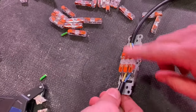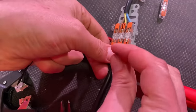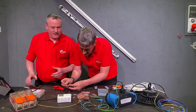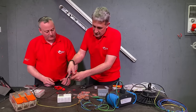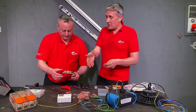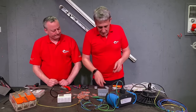So you could be mounting this in a control panel or possibly in some trunking — though putting connectors inside trunking is a question for another time. A tie wrap will hold it in place, so it can be mounted inside an enclosure with the flex secured. It's been quite satisfying — we've been playing with them off camera for a while, but actually clipping them into place, they're very tactile. And compared to butt or through crimps — where you're balancing a tool, inserting the conductor, and remembering to twist and flip — there are no issues here at all.